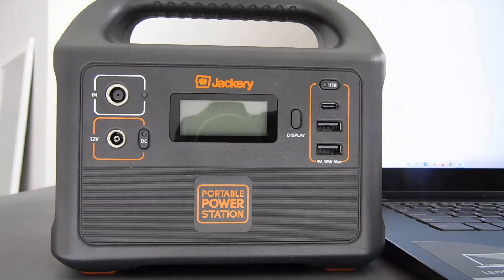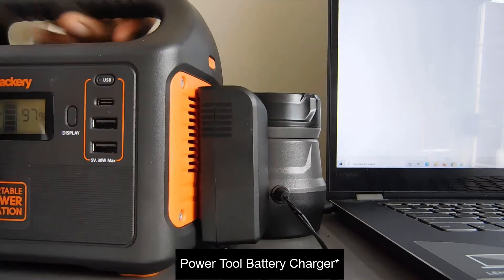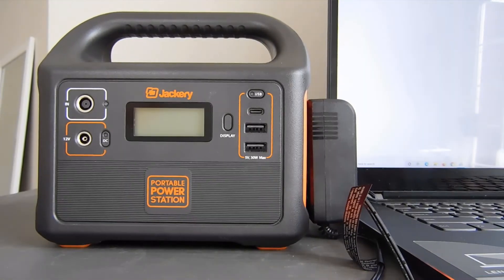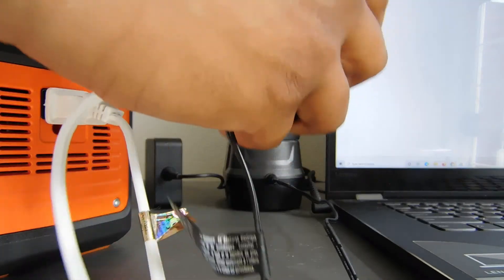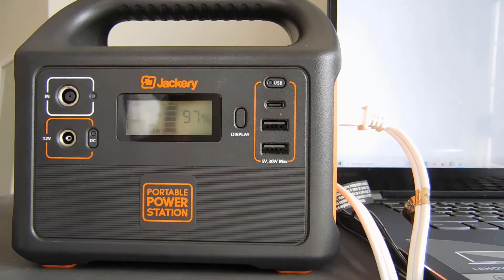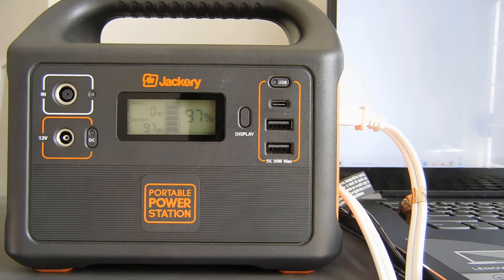We're going to grab a power tool. We plug in the power tool and run the same test. We're seeing 45 watts here. So we've got about 61 watts from the laptop and about 45 watts from the power tool. What if we run both of those loads at the same time? I've got a splitter, and we're going to plug in the power tool and the laptop simultaneously. We'll see if the Jackery can output the 100 watts we're expecting. We're up to 85, then 101 watts — we're hitting that 100 watt output very steadily, creeping up and down around that, and holding on pretty nicely.